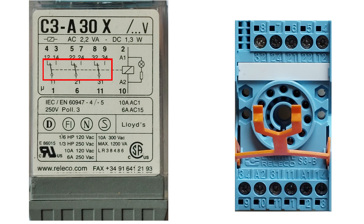Then we have three switches that will change position once the coil is triggered. For example, if we want to wire up the first switch, we first give it an incoming current to terminal 1 on the relay socket. The maximum current we want to put on here is 10 ampere with 300 voltage — else we can burn the relay. Then on the other side, we can decide if we want to wire the output to either terminal 4, which is a normally closed output, or terminal 3, which is a normally open output that will get contact once the coil gets triggered.